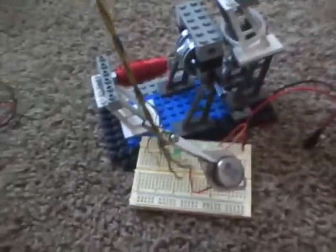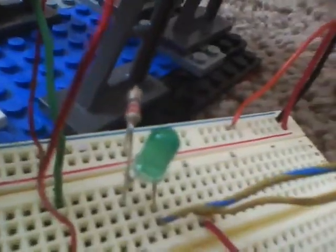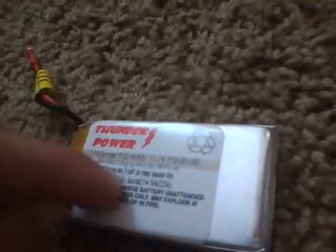I'm ready to fire this thing up. I'm going to show the two power options I have. The first one is running off the 9 volt with a 22 ohm resistor and a 9 volt battery snap connector. The second one is a 1K ohm resistor with a JST style plug and my radio-controlled airplane battery — a three-cell, 11.1 volt battery that'll pump out almost 22 amps for a short amount of time.